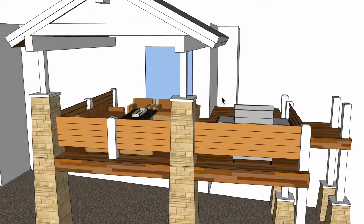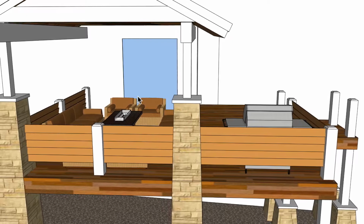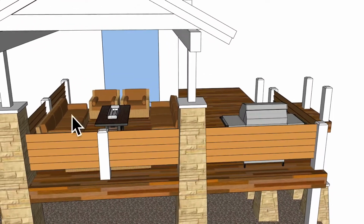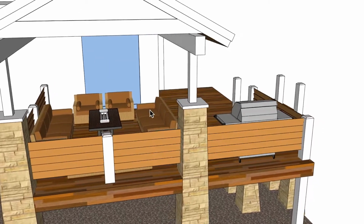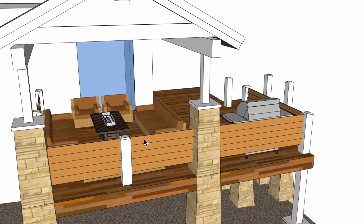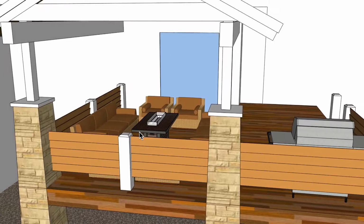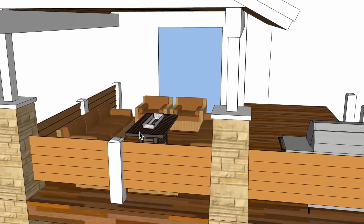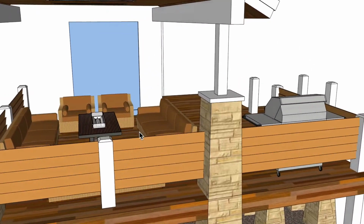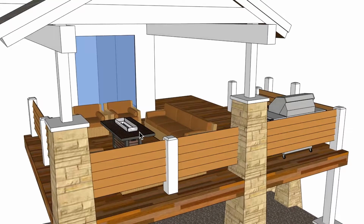Infrared heat is where you are placing infrared, a light wave. That light wave needs to travel. It comes down and penetrates the seating area, it penetrates mass, I should say, really. That mass meaning the human body, the chairs, tables, floors, but you don't want to penetrate something so intensely that it's uncomfortable to sit underneath. So we can't put enough heat in to make everyone satisfied at temperatures below really the 50-degree level.